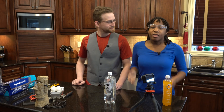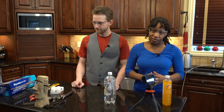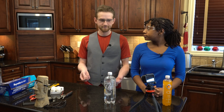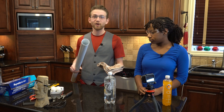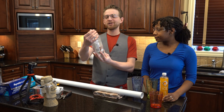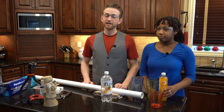Let's get everything ready. There are a lot of different ways to make a Leyden jar. We will be using plastic bottles, aluminum foil, and salt water, and some stainless steel screws. We're also going to be charging it with a PVC pipe and a normal cotton cloth. You could use paper towel or wool if you wanted, but it doesn't really matter.